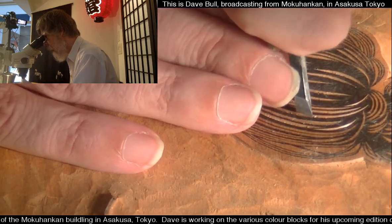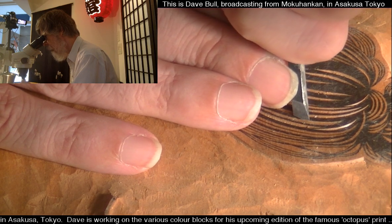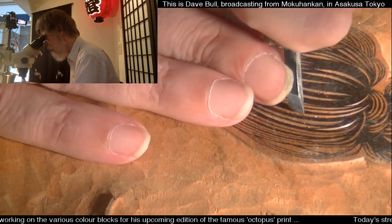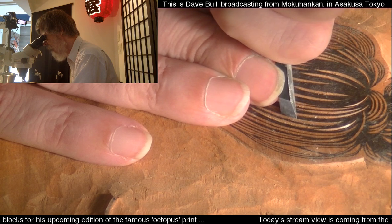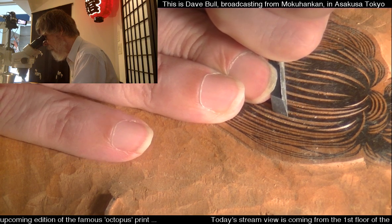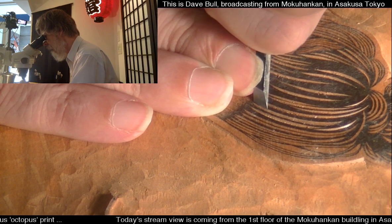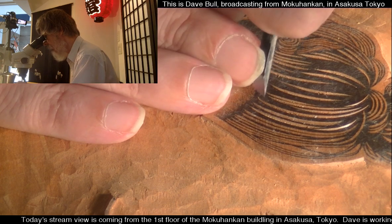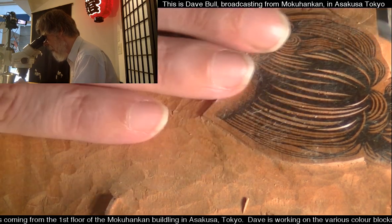This is a wider one. The wider ones don't come out in a single pop because in order to make them come out like one, I'd have to dig the knife in too deeply to make these V's match. And that would stress the wood too much. So I'm putting it in fairly lightly. And as a result, the V wood won't come out in one piece. But that doesn't matter. That's not a goal. At the end it does because it's quite shallow here. So this is going to pop out at the end, this part. But the middle area here won't come out.